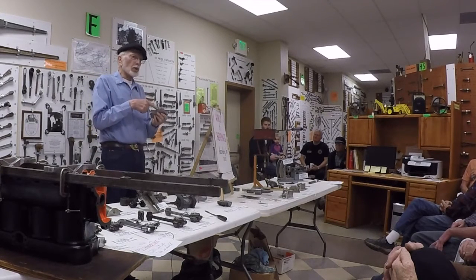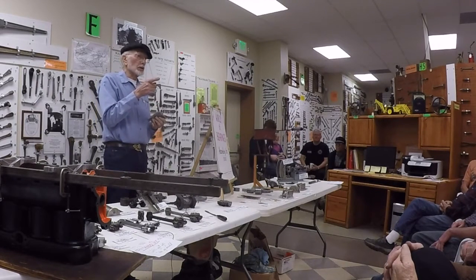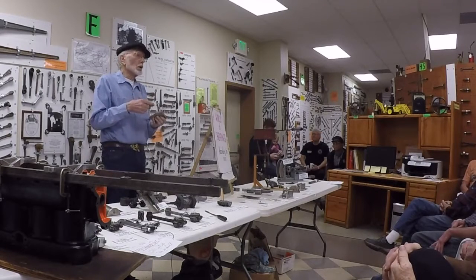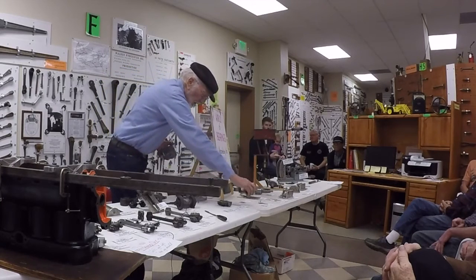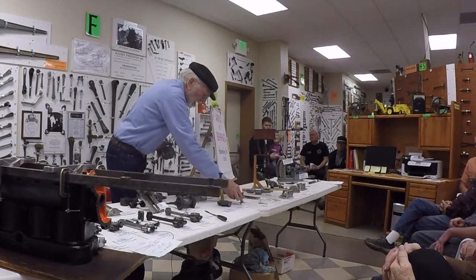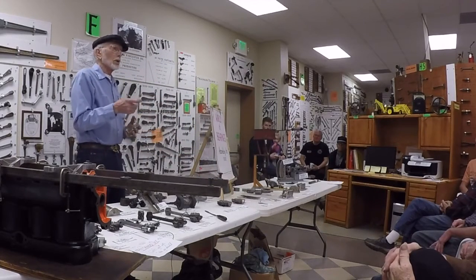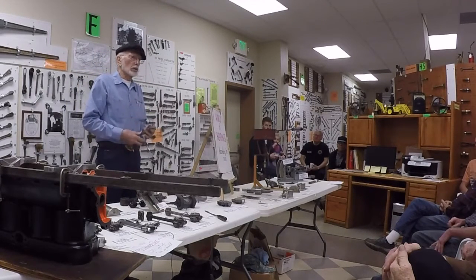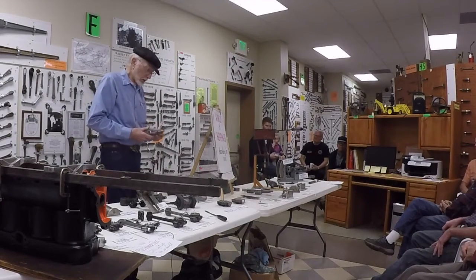And then you heat up the pouring fixture for two reasons. Those of you that do bullets and fish weights, you know why we do that? Yeah, you want to get the moisture off the pouring fixture, because room temperature, or worse yet, cold metal, will sweat to beat hell when it gets hot. That's why guns sweat when you bring them in out of the cold from hunting, and you put them in the corner of the room and moisture runs down. So you pour babbit into that thing when it's cold, and you're going to be wearing some of it, and it goes right up on the overhead, in your hair, and other places.